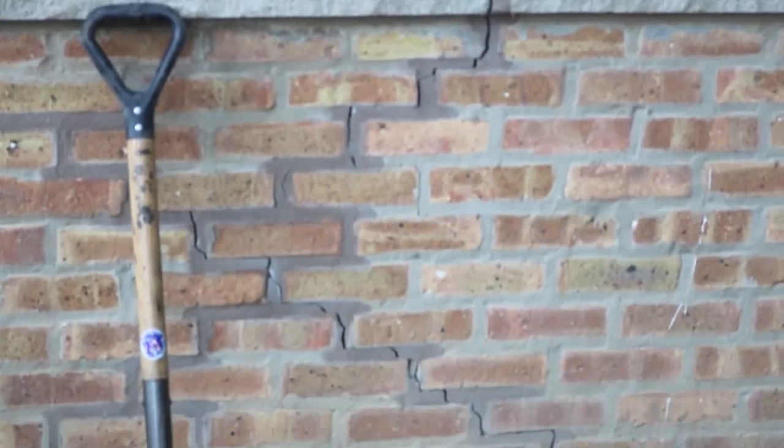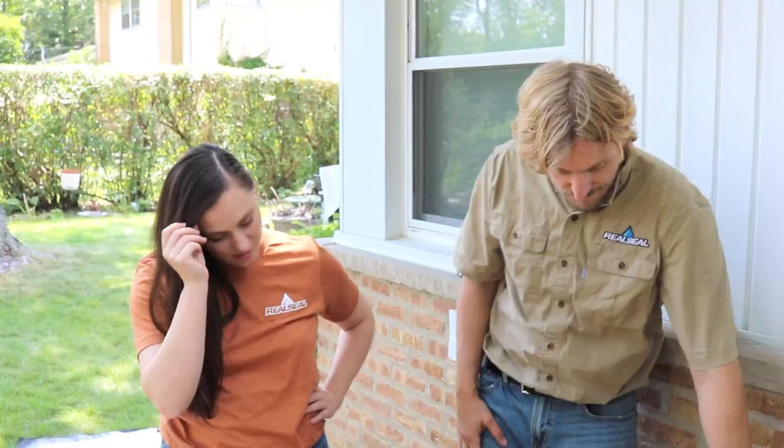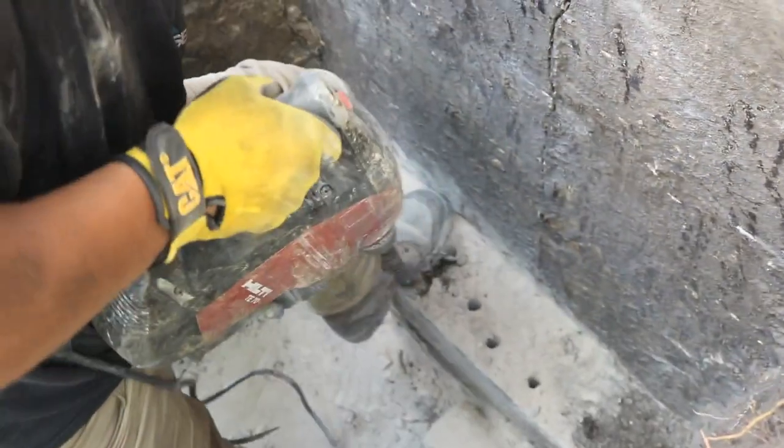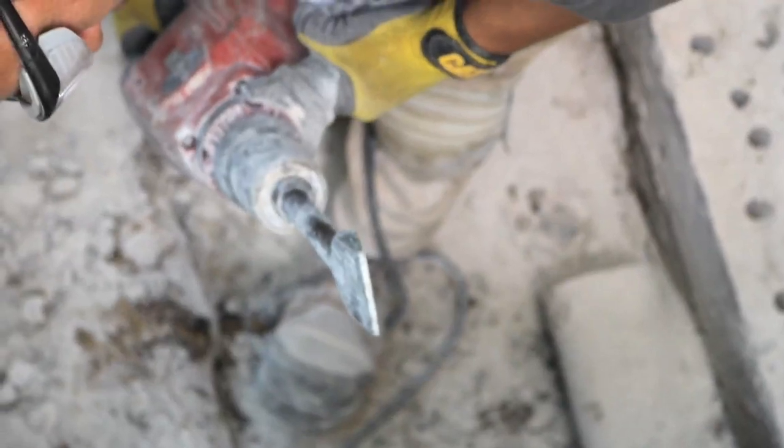This is going to result in the roof being pulled apart, siding and brick cracking and being pulled apart. So this house is settling. What did you do to the footer? That's one big hunk of concrete, right. The foundation actually doesn't just sit on a straight wall — it has a flattened-out bottom piece which we call the footer, and it's about six inches on either side of the foundation wall.